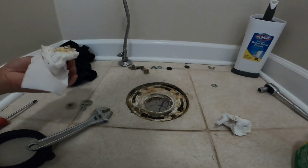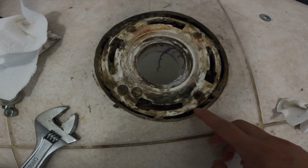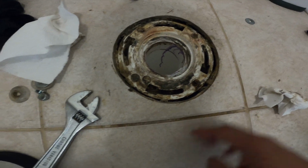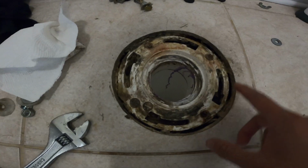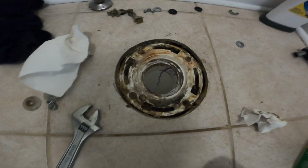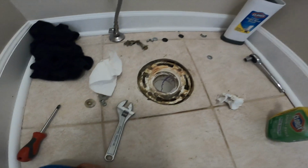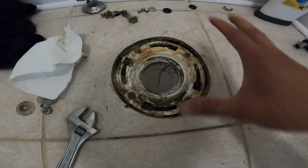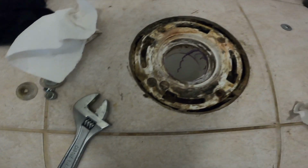Okay, so as you can see, the reason why we're having leaks here is it was clearly coming out after you were flushing it, so there's a lot of crud here. So essentially what this seal should do is make sure once it's installed here that none of this can actually get out. This seal is flush and it's better than a wax seal because it's actually solid material. So that should never deteriorate away, and that should solve any of the issues with the water flushing out and going this way or anything like that.